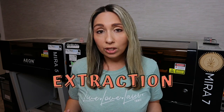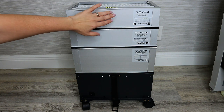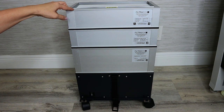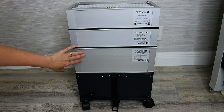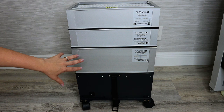My next tip is to look for a fume extractor that has multiple filters. This way you can ensure optimal fume extraction in your workspace. That would mean a fume extractor that has a pre-filter, a HEPA filter, and a carbon filter. The pre-filter catches all of the larger particles from your job. The HEPA filter catches all of the smaller particulates. And then the carbon filter breaks down the fumes and gets rid of the smell.